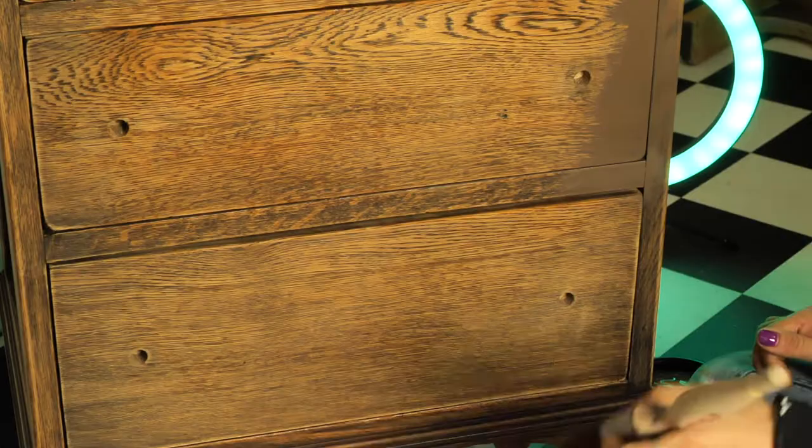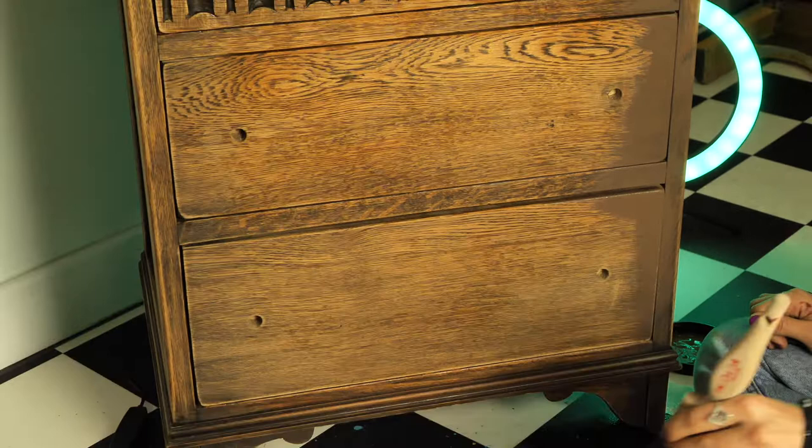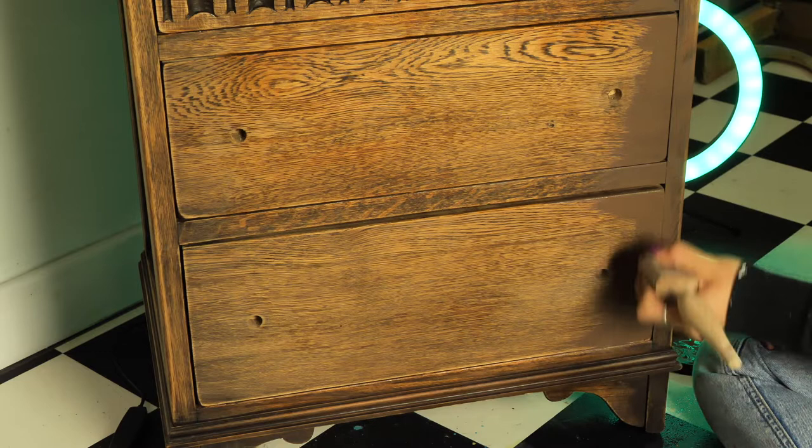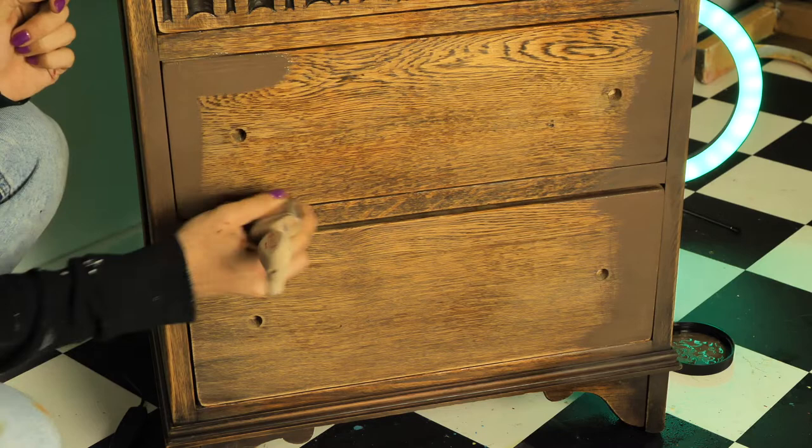There will be like a two centimeter gap on each side, which will be covered with brown, and it will also help us to blend in the transfer. I kind of faded the brown towards the middle of the drawer, so we don't have a straight edge when applying the transfer. I also wiped a bit of the Chocolate from the edges to leave some of the wood revealed.